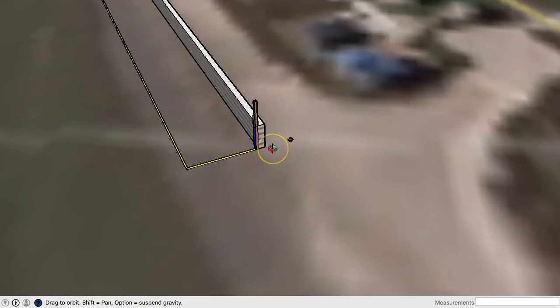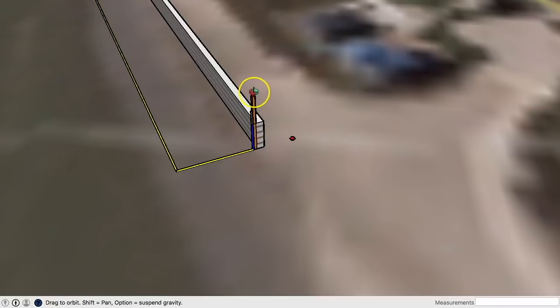As we drill down here, what we're going to need to do is plant our first post in the sand. We'll use a post hole digger, we'll dig a hole, we'll plant the post in the ground. We'll use wet sand to pack it back in. We'll use levels to make sure that this post is perfectly perpendicular.